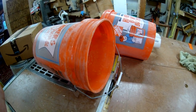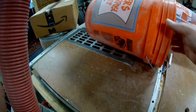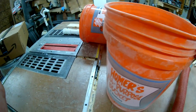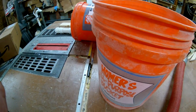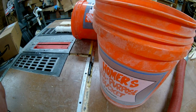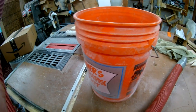Except it doesn't hold very much. When you're planing something and a lot of sawdust and wood chips are coming off, that five gallon bucket gets full before you know it, and if you don't realize it, it gets sucked into your vacuum cleaner and your filter is all messed up and clogged up and your vacuum cleaner is slam full.